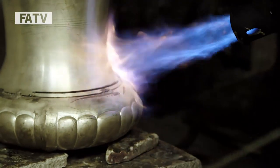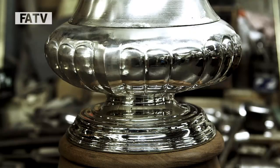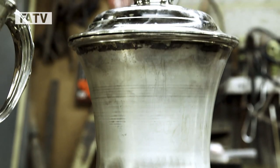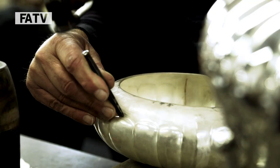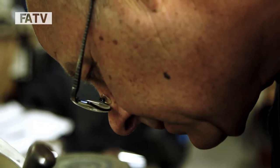This Cup is actually being made exactly in the same way. It's being made by hand, it's being hand chased, it's being hand formed and made from flat sheet. Chasing is a form of putting the design in by a series of little tools and punches — the pattern is actually put in. It's not cut out, it's not carved out, it's actually pushed around.